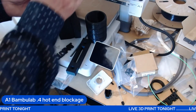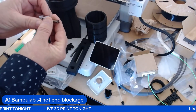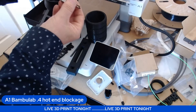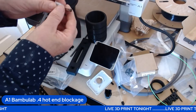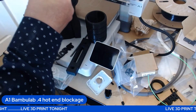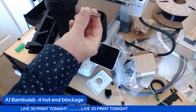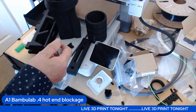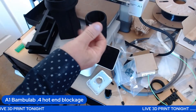When it's working this thing is brilliant. I suppose all printers will get clogs — the 0.4 nozzle is so small. The plastic has to come through under pressure and squeeze out of that tiny hole in a constant flow. You can see the ridges on the filament where the motor's been trying to push it through but it won't pass the blockage. You'll see YouTube creators like Monkey Maker show all the stuff they're printing but not show you all the clogs — we all get them.